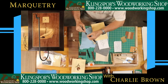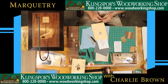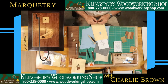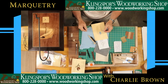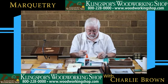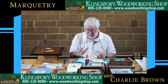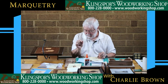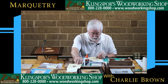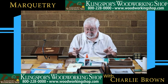And another question is, well, how long does that glue have to dry? I think it probably dries in 10 minutes, but that doesn't mean that you can't go ahead and cut through it. Now, if you've got a small piece there that you're worried about popping out, you want to give it a little more time and maybe move on to another piece if you can do so without upsetting your order of cut. Just like I told you, order of cut is very important, but you do have some options.